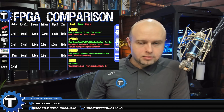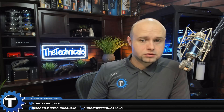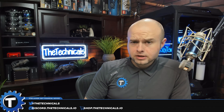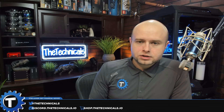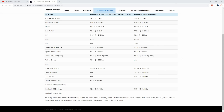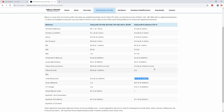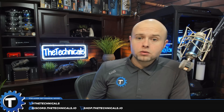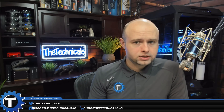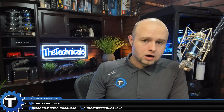I'm not sure how bitstream compatibility translates over to the CVP-13 or the Black Miner F1 — whether a bitstream written for the BCU can be slightly tweaked to go onto other cards, or if it requires fundamental changes. However, almost all bitstream writers I've seen are writing them for the BCU slash VCU. So if you get into one of these cards, you can expect that when new bitstreams are released, they'll be available on the BCU/VCU 1525 series — that is a positive.